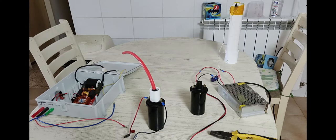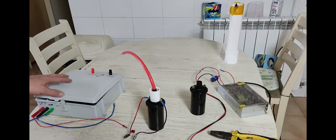It's an AC flyback transformer, there's no rectification. If I wanted to drive a medium-sized Tesla coil, this thing works beautifully. If I wanted to drive my 8-stage CW multiplier, again, it works beautifully. Don't really need to do this, but I have so many of these, I figured I wanted to see if I could do anything useful with these ignition coils.